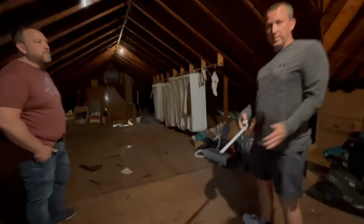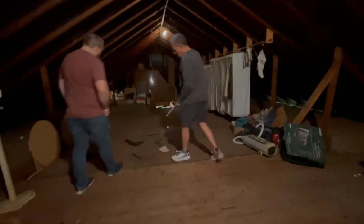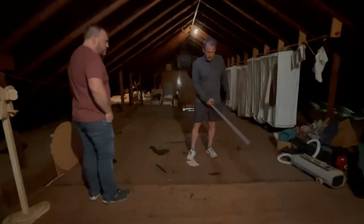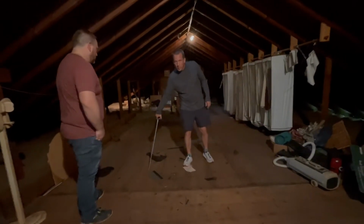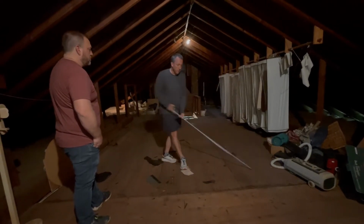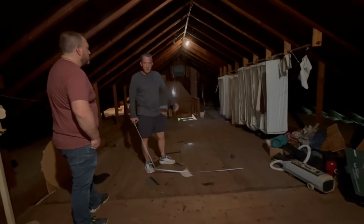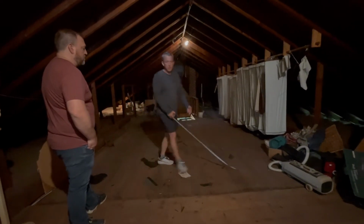Okay. Cut these spans down. Right. So like this hallway, if there's a bearing on these joists, if they're bearing on the hallway there and the hallway wall there, then we've got a really short span. You know, we don't have that 13-foot span there. We've just got a 6-foot span. Okay. So that changes a lot of things.